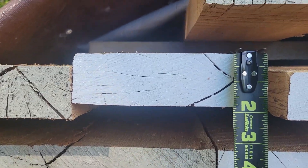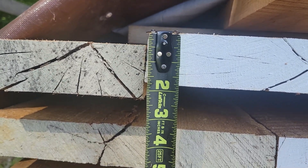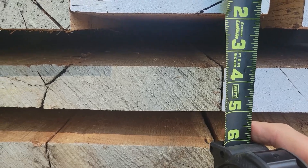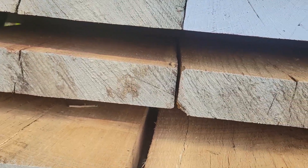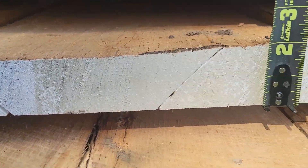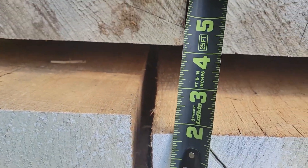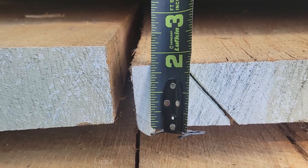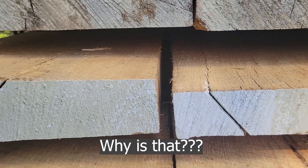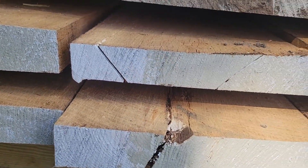This one kind of the same thing — we start out at a beautiful two inches, then down here it's two inches, eight quarter... no, it's a little bit less, seven quarter. Had the ruler on wrong, the whole thing's a little bit cockeyed. Now look at this one here — this is one of the two by twelves. It's exactly eight quarter, exactly what the doctor called for, and down here it's less than seven quarter. You can see how this end is a little bit smaller and this end a little bit bigger.